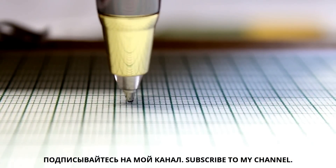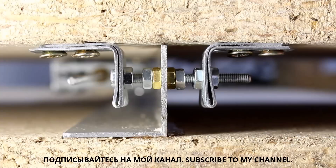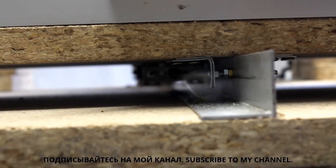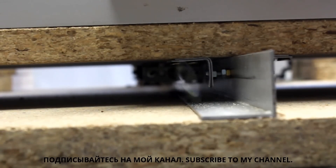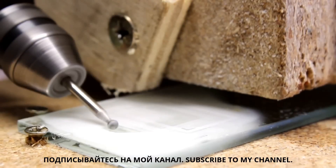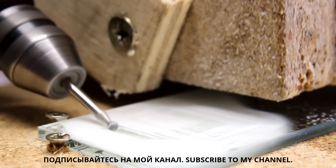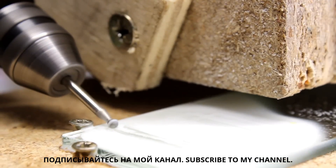In plotting mode there is almost no side load on the ball pen, but the router has to be pulled with higher force over the glass plate during engraving work. As you can see, the aluminum bars as well as the iron angles are deformed under load. The threaded bars are also a source of inaccurateness — the end of the X drive starts vibrating at a certain speed and position. An additional guide will limit the amplitude of those bad vibrations. You always have to be aware of resonance vibrations when using a CNC machine. If the router moves with a certain speed and downforce along the glass plate, the mechanism starts vibrating vertically. Avoid that operating mode by choosing appropriate machine parameters.